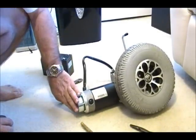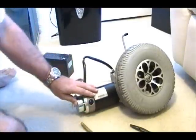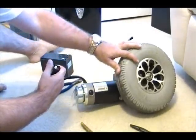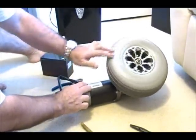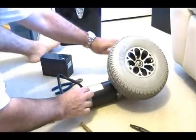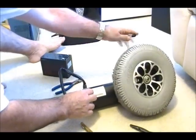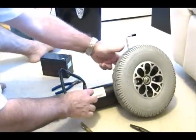Here's the brake I'm talking about. What happens with these things — if you try to use it for robotics, I've already tried it the hard way. You take a battery, hook it up, and sparks fly. The wheel doesn't turn. Right now the wheel is free-running, but there's a mechanical lever on the side that, when engaged, locks it. This is not really a brake — what it's doing is engaging and disengaging a worm gear in this housing.